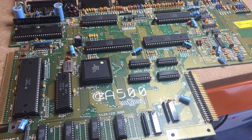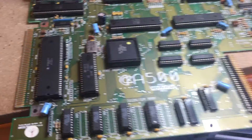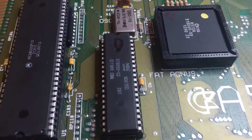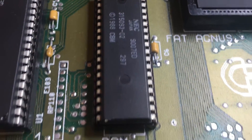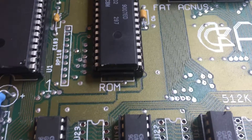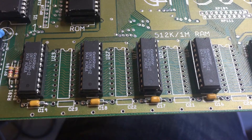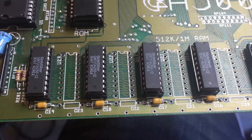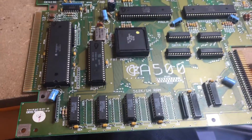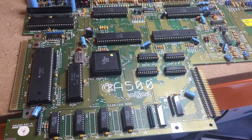I thought I'd share this because I've spent quite a bit of time on it and I didn't see anyone else who had the same problem. I saw people with possible ROM issues who said to swap the ROM, but I'd already done that from the other machine. So the only thing left was the chip RAM — and lo and behold, that was the problem. I look forward to putting this machine back together and selling it on eBay. If you're interested, send me a message. Thanks for watching!